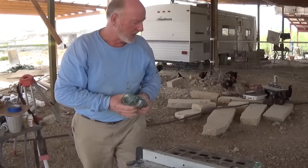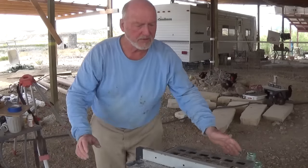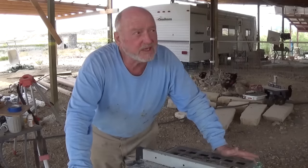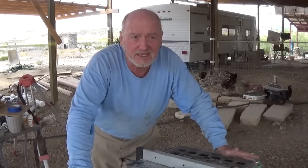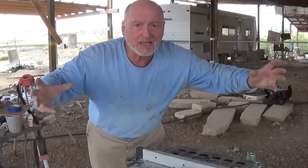When I built my kitchen and when I built the bathroom — the guest bathroom here — I believe I went 14 inches thick. And the advantage to doing a bottled brick, putting the bottoms together, is that it looks good from both sides.